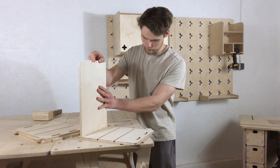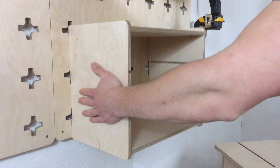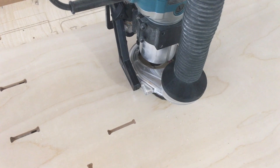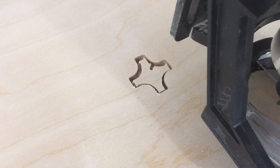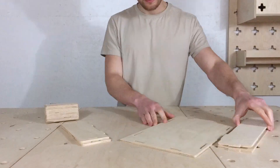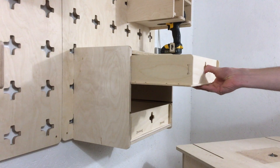Attachments like drawer cabinets required way more parts, mainly because of the drawers. I could make the cabinet frame out of four simple pieces and use plywood offcuts to cut the drawer parts. To make the drawers look like part of the pegboard wall, I made crosshead screw shaped holes in the drawer front panels — these serve as drawer handles. The bottom drawer was just a simple box, however the sliding drawers had extended floor panels which fit into grooves of the cabinet side components.